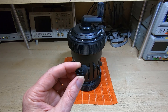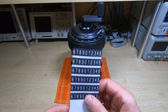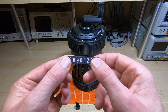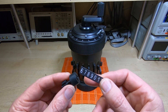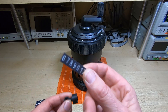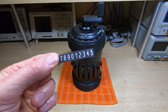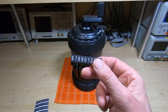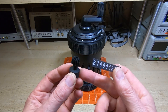If you work out the length of the piece of paper needed to wrap around - which is the length of the printed digit paper - I came out to 58 millimeters. Using the files that Marcus provided, I simply print them on ordinary paper and then use a knife to carefully cut them out. If they're the correct length, they should wrap exactly around the digit wheel. The size you make them depends on the size you end up with on your digit wheels - just measure it, work it out, and then scale it when you print.